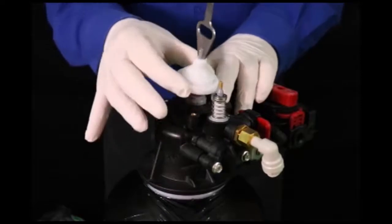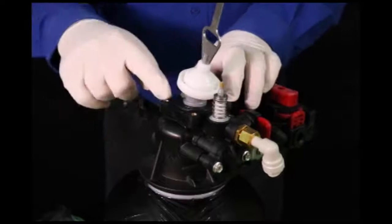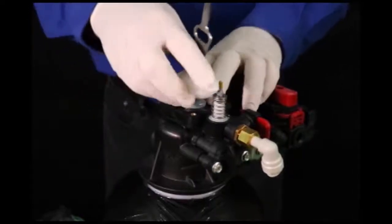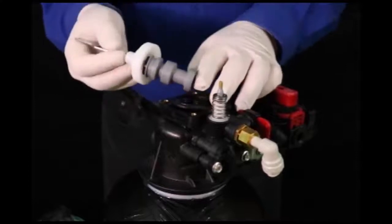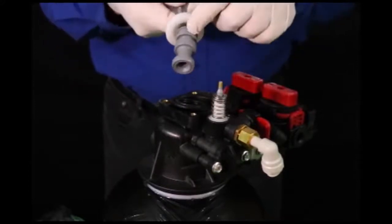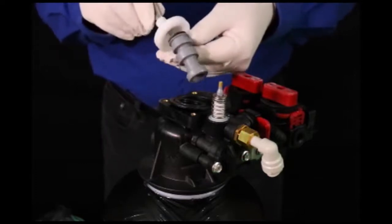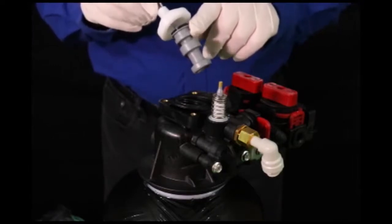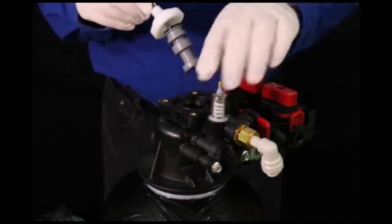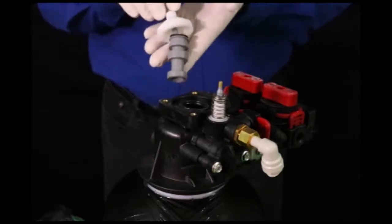See how that moves up and down on this rod? Lift that up. Get your fingers down in here and hold your seals in place, then gently remove the piston. You would want to look at this piston — look for any scratching, any wear, any damage at all that would allow water to escape around the seals inside the control valve. If that were to happen, the system would malfunction. So that's the first thing you look at — that's your piston.